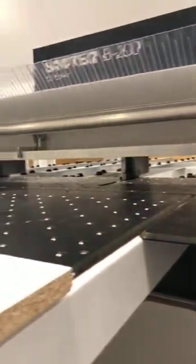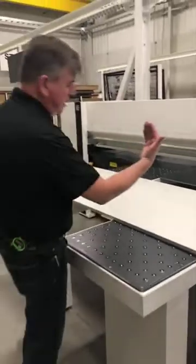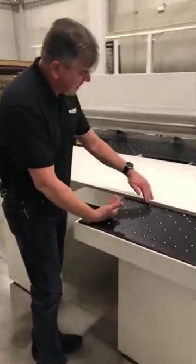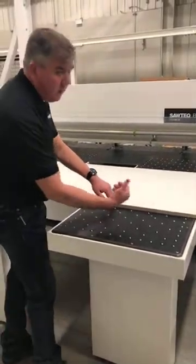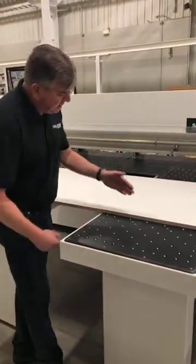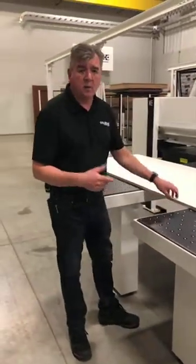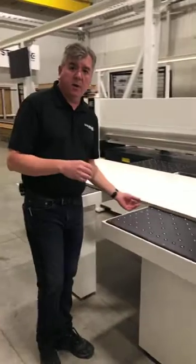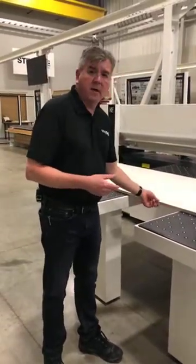This is a two-axis CNC controlled situation. My program fence knows where it's at, and so does the saw carriage. On a panel saw, my saw carriage will actually pop up from the cut line. The main saw will come up and cut from the top down. In front of that I have a scoring saw, which comes from the bottom — about two millimeters. It makes a slight score so the main blade doesn't chip out the bottom, allowing me to cut delicate materials like melamine or laminate cleanly on both sides. It even gives me a superior cut on plywoods and MDFs.